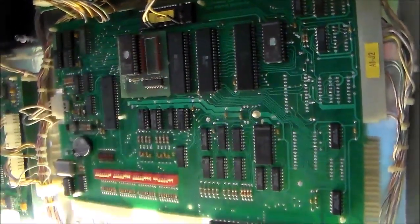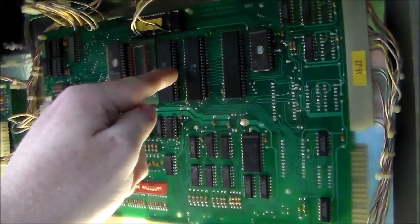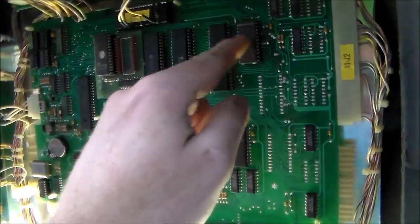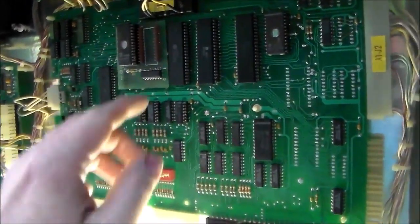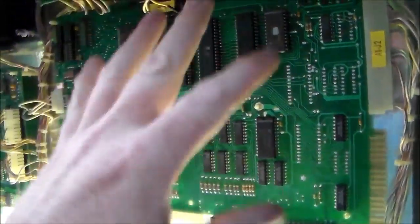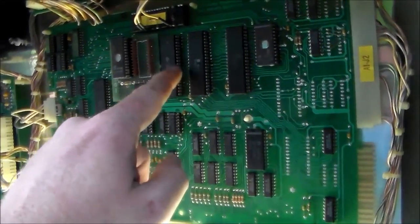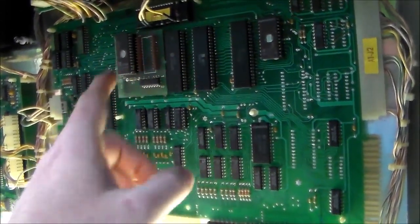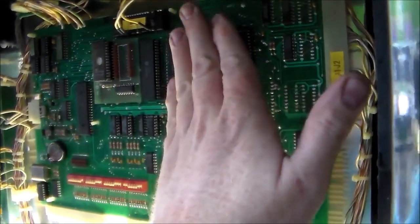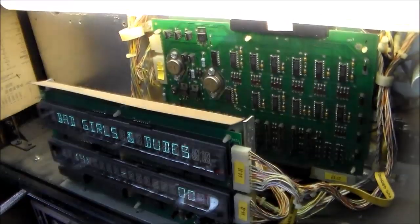Now whenever I replaced those and it still wouldn't boot, the reason was because I screwed up one of the pins, pin number 30, which connects to this one and this one and this one. So basically everything was working up until here, but then it couldn't recognize these. I was testing it with my logic probe and everything, and I replaced some of the things in the clock signal, and all of this was a waste of time. The pin was connected to the CPU like it should be, but it wasn't connected to the next one. So it had disconnected these 3, which is why the MPU still wasn't booting. So once I got that all figured out, we're back up and running.